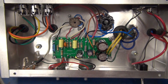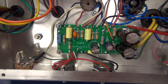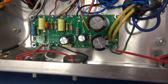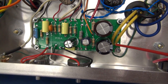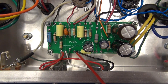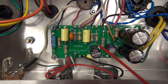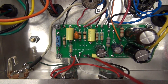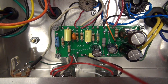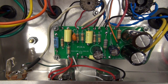Part of the magic to reduce hum and buzz on these small amps is to actually have two sources of ground. G1 is the power supply ground — it only goes to the main filter caps. Then G2 is the preamp ground. This cap and the preamp circuitry is grounded through a separate source. That little bit of resistance between the two grounds eliminates a lot of noise. You'll see this on some of the Fender Champ designs.